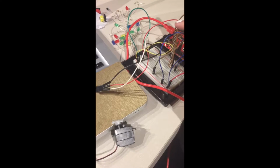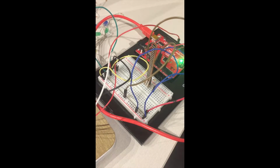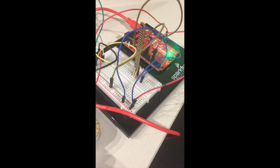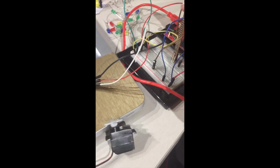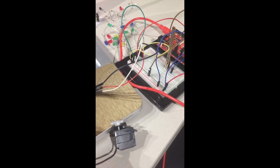So this is circuit number 9, flex sensor. Here's an example of it. So it goes with the flex of the sensor. And we basically map the input from the sensor. We use the analog read position to read the flex position, and then we map and constrain that to the servo position angle, and use the serial print function to print to actually output the position inputted by the sensor onto the servo. And then we use the delay function to wait between the servo updates.